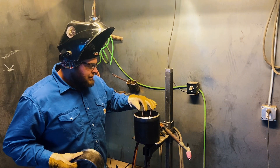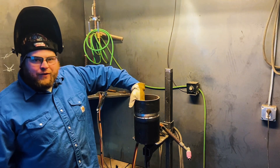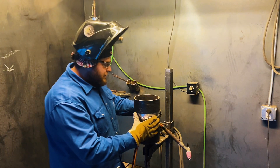For the fit-up, I like to run a loose 5/32 gap, so I'm going to put my 5/32 gap wire in here and I'll end up wedging one side open so we can get a little bit wider than the 5/32.